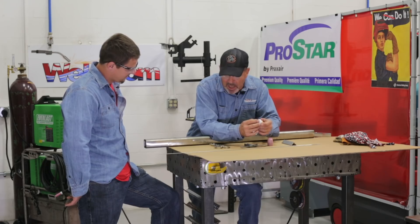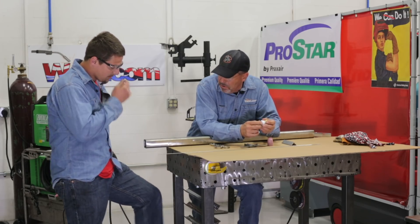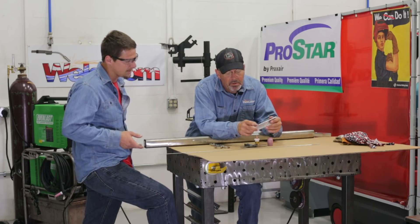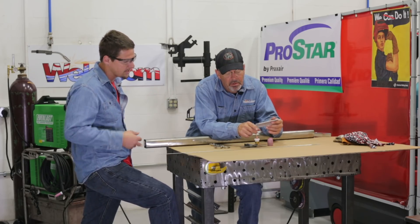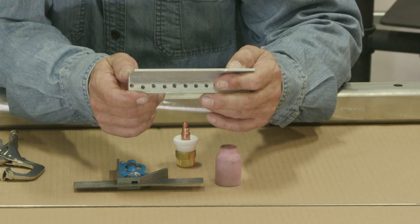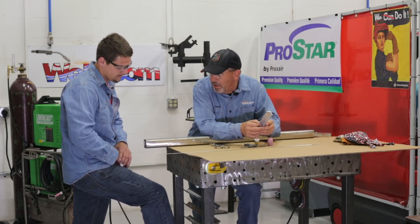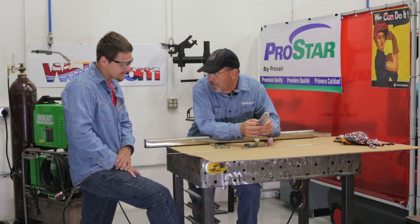I'm going to run about 145 to 150 amps. What are we going to do about the bottom of the hole? We could do it a couple different ways. The way I'm going to do it — you get a piece of aluminum or brass, put it in here, clamp it, then go ahead and weld it up. This is not critical; we're not trying to get way down in the bottom of the hole.